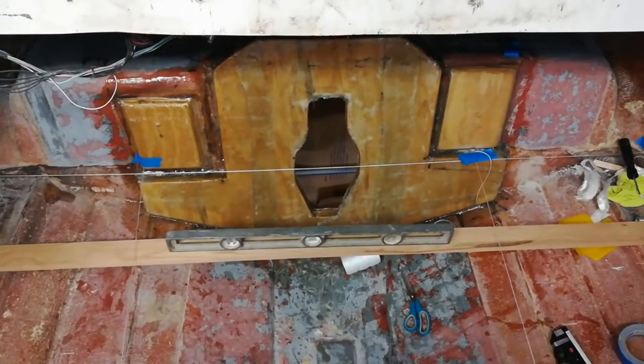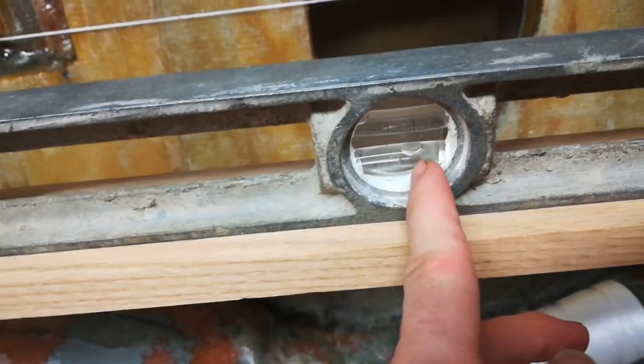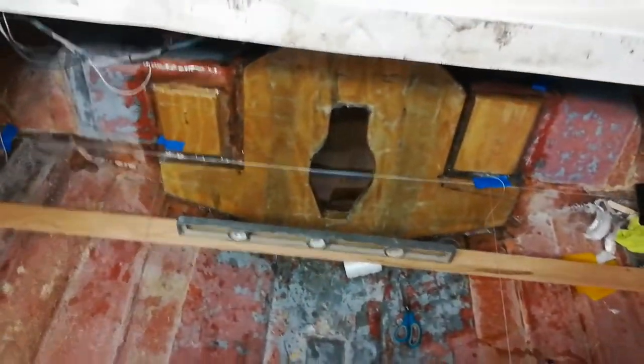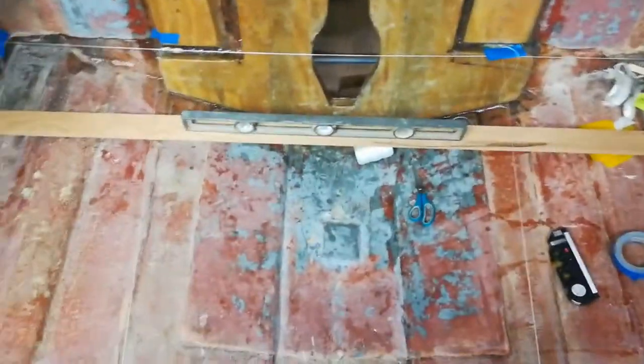I was just about losing my mind until I realized something. This should be perfectly level side to side, but if you look at the level you'll notice it's to the right — it's actually leaning downhill on this side. The reason is because of how it's sitting on the boat trailer right now. The support on this side is tilted up a little bit towards the front, causing this side to be a little higher. So when I'm making the deck it'll actually be sloping that way slightly — a perfectly level deck is going to be unlevel relative to the earth right now, and that's okay.